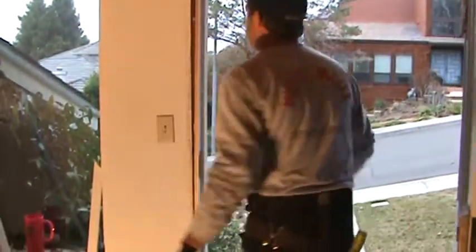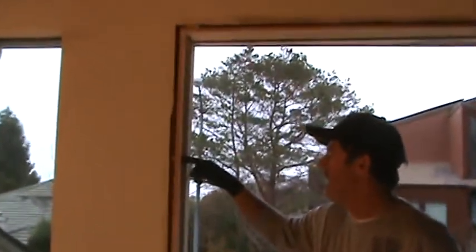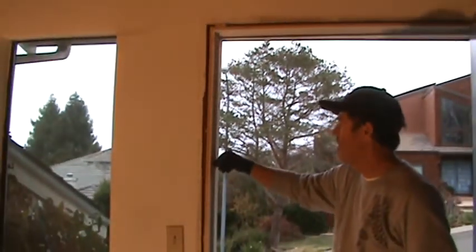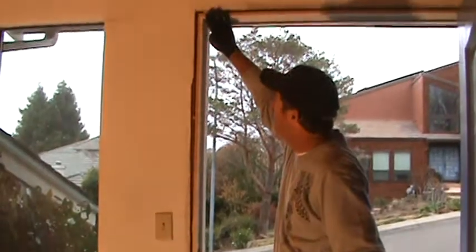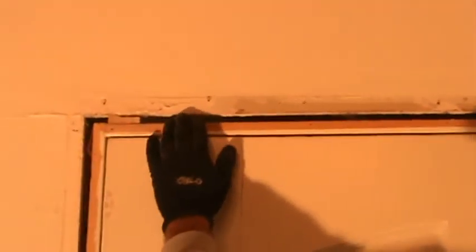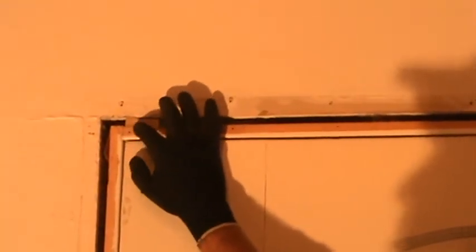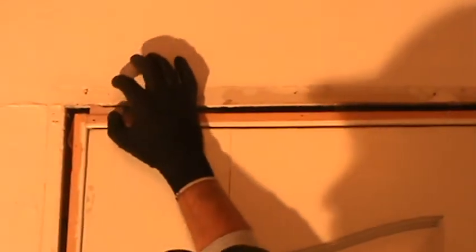I'll go ahead and put a couple more screws in here — you can use finish nails too, but I've got some sheetrock screws and I'll countersink the heads, then put caulking over the tops. I'll also have to attach my trim that I took off — we removed that very carefully. Up here, remember that huge gap we had? You can see it's all lined up now. I tapped this back down and put a little wedge between that and the sheetrock to keep it down.